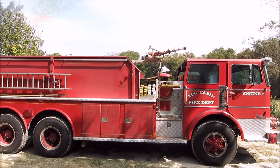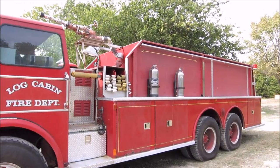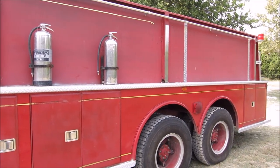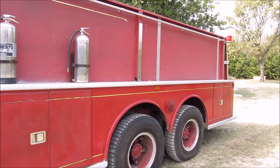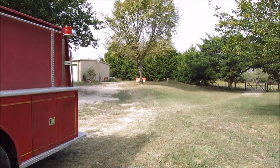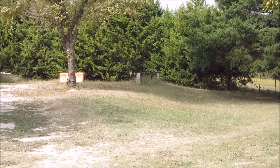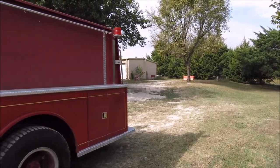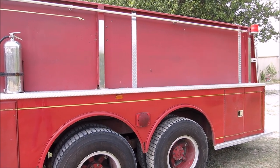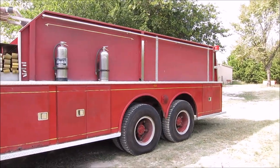I've got something pretty neat to show you on this side of the truck. The first thing you'll probably notice is that I got rid of those dinky little fire extinguishers and put proper water cans on there — the brackets are already there for them. Now right here on the side, you'll notice there's a missing cage. There's a metal cage that holds a device — it has hinges on the bottom and it flips down. It's basically a kiddie pool on the inside that you fill up with water, and that allows another apparatus to draft from, say you're not near a pond. You can fold that cage down, extract it, set it up, and then draft another apparatus if you have a tanker coming in to dump water. This one has a tank dump on there and also a big pump, so it's a pretty capable apparatus.